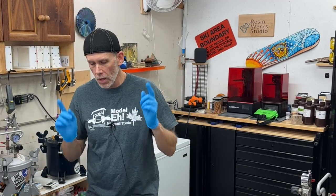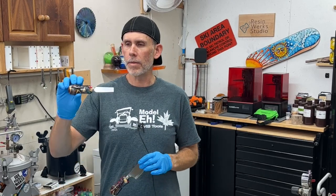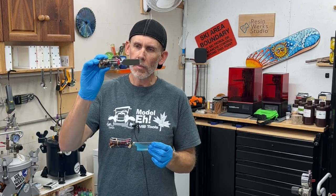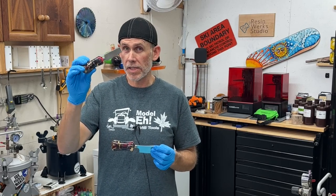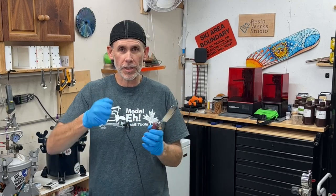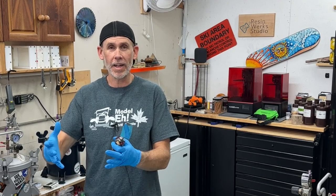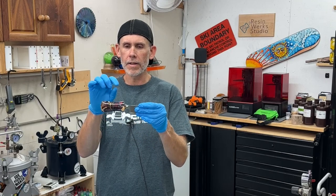One thing I do want to note about this kit or this set, it said, and I didn't read the instructions fully, but it said that you needed a 7mm hole, and I drilled a 5/16, thinking, okay, they're all gonna fit, and so I just assumed that these things were all the same size. This one's much bigger. It doesn't even fit in a 5/16 hole, so I'm about to glue. I got 5-minute epoxy setting up on me, and I actually had to take this over to a grinder and grind the tang part down.